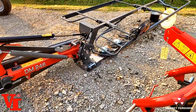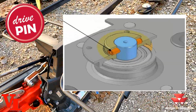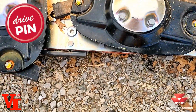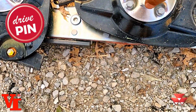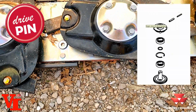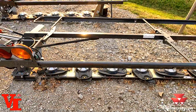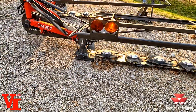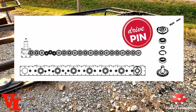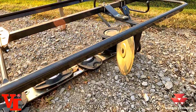It has drive pin protection. We have done another video, but if you go underneath this hat, take these 4 bolts off, this drive hub is double roll pin through the shaft coming out of the gear in the cutter bar. This is a Gearbed cutter bar. Very familiar. There's a lot of Gearbed cutter bars out on the industry from Europe and American manufacturers.